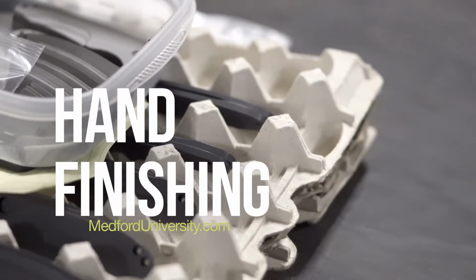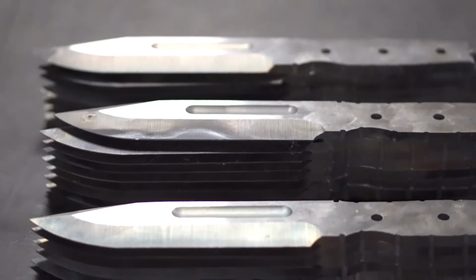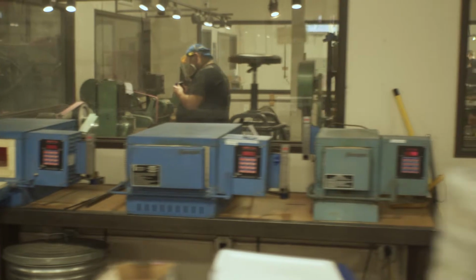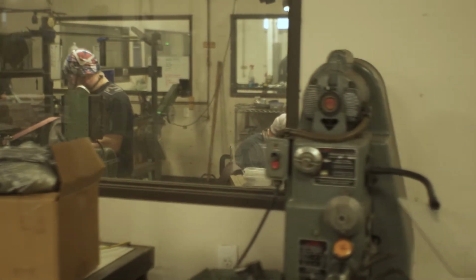So up till now, you've seen a lot of machinery, and what the machinery gets us is a level of repeatability. And we repeat everything on the back side of handmade so that we can sneak it up to the handmade tolerance, which is no tolerance at all. What I mean by that is if you make all the way to the production level, you're gonna have a plus minus variance that kind of gets into your fit and finish. That's something that I don't make at this point. We still make a hand-finished, hand-fitted knife.